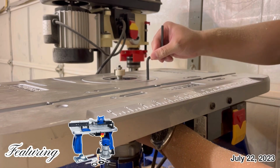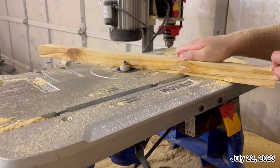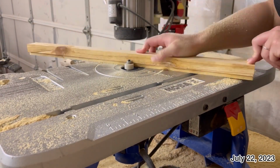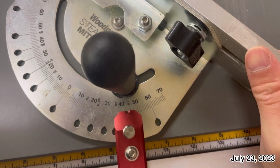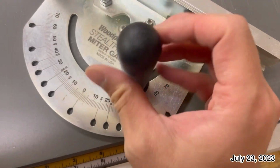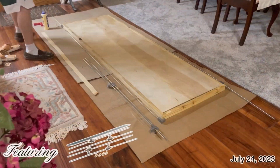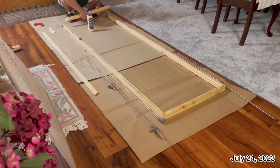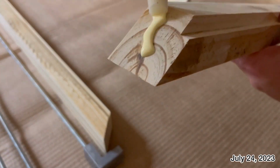I cut a groove along the edge using a cobalt router table. I cut 45 degrees off the corners so these pieces fit together like a picture frame. I assembled the panel using 4 studs and 1 plywood backing. The grooves are what will secure the plywood body, giving the wall more support.